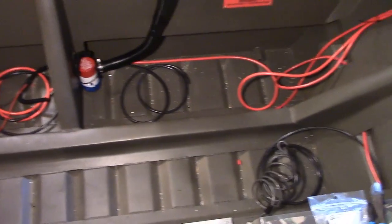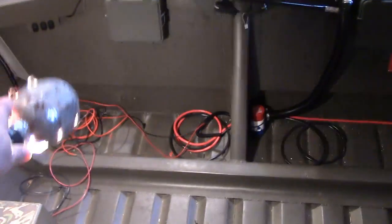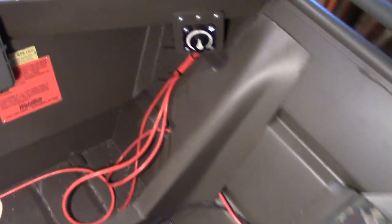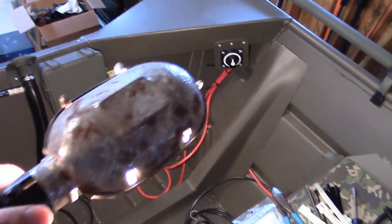The battery setup will be four Group 31 batteries back here. One sits on this side, one on the other side near the bow, plus two gas tanks in the middle — it evens the weight out perfectly. A battery switch will manage them: I'll run my trolling motor off two batteries on this side, and my electronics off one battery. Halfway through the night if I start running low on trolling motor power, I just flip that switch and the trolling motor runs off the other two batteries.